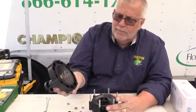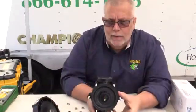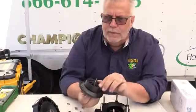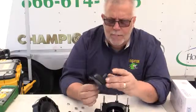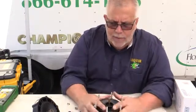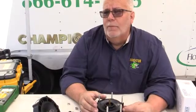I like that the bonnet, the way it's set, has a very captured spring on it right here. As you can see, the diaphragm is a nice molded diaphragm — very clean, very nice. It fits in right here. Pop that open, the valve opens up. You've got a great seating area, great diaphragm, good molding material, and it pops right back in. It's interchangeable with a similar brand, which saves you a lot, and in the field it's very easy to take apart and put back together.